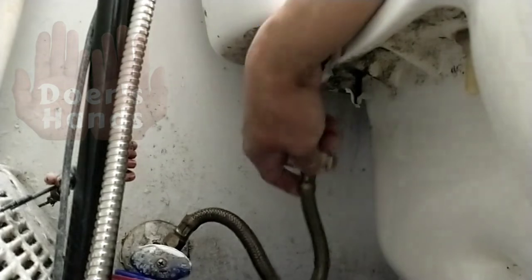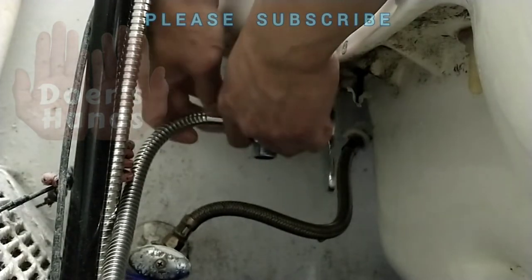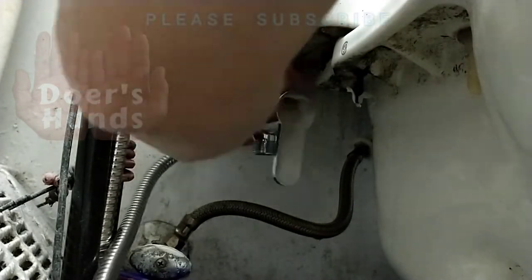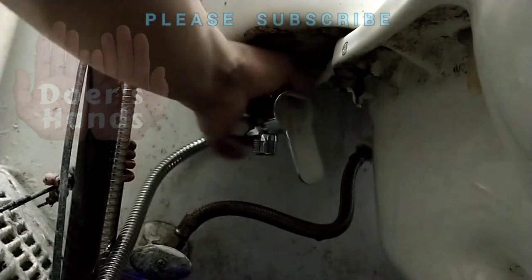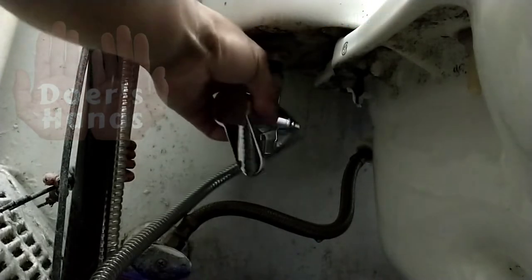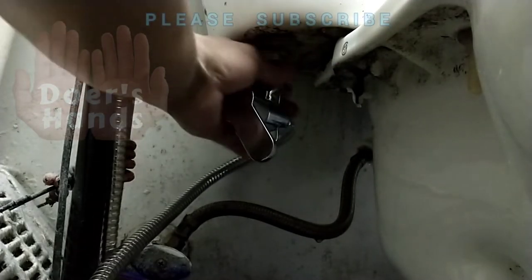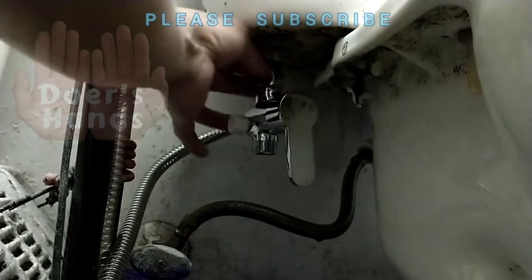We can leave it in this bucket. We'll reattach this. Not much space, it's hard. I can do it. Since the gasket is rubber, you don't need to tighten it so hard. Just to make sure there's no leak is enough. Because we don't want also to damage the gasket by over tightening it. That would be good enough.